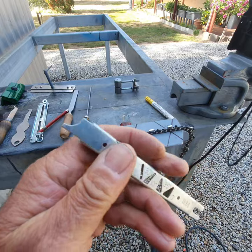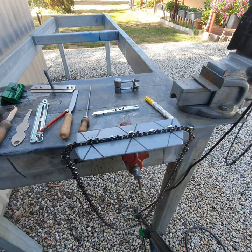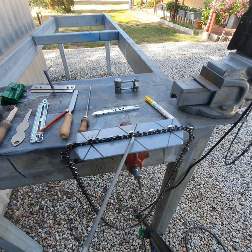This tool is to clean the bar out. A lot of people say they don't take the bar off — well, if you don't take the bar off, you're not checking your saw, and checking your saw is good maintenance. Anyway, we're here to go over how to use a file. The main thing is when you use a file, you'll see these little X marks — they're at 30 degrees.